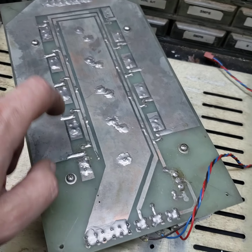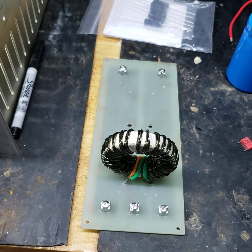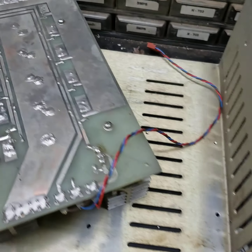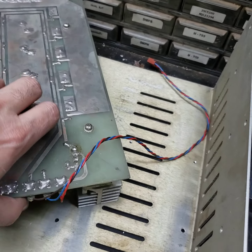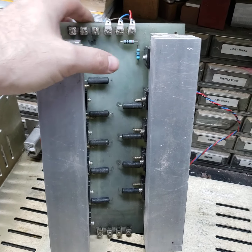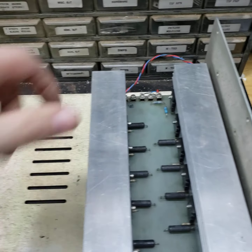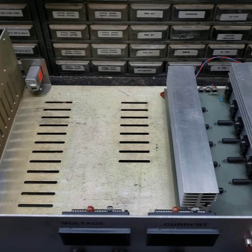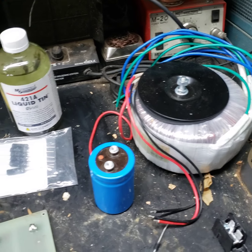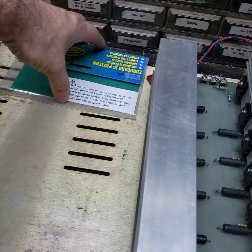This board we're only going to rate for about 35 amps, maybe 40. We'll make a pass regulator similar to this in the future, but it's got to be more compact because we're running out of space in here and we still have to fit this thing in there somehow, and then fit the control boards in the stack. It's going to run out of room pretty fast.